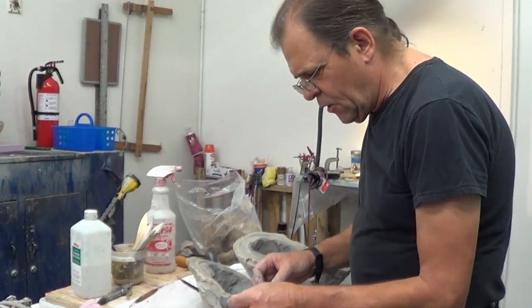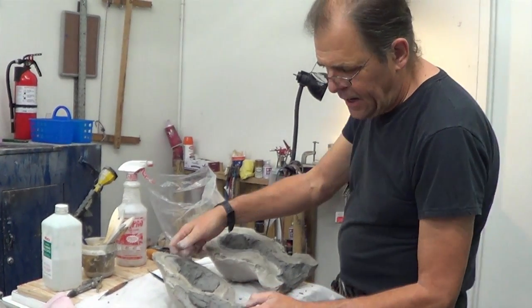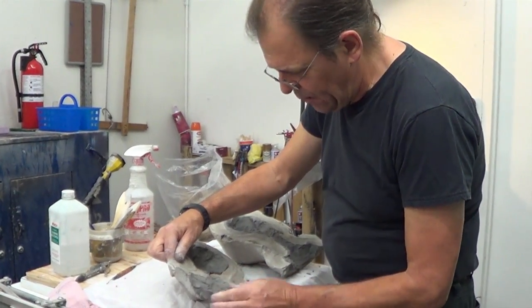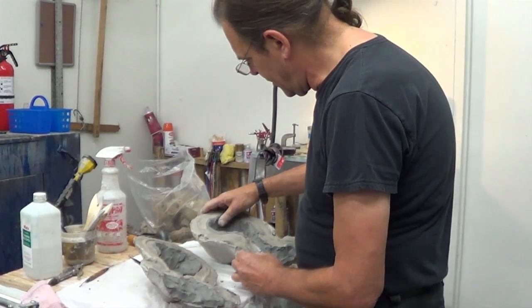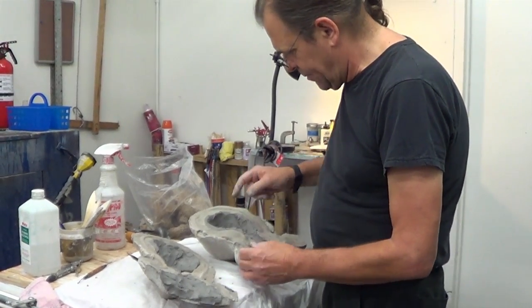Time to core the Martian mold, and what I'm doing is I'm taking the layup clay, the white clay as it's called, even though it's gray, and I'm laying it up inside the mold. Now what I'm trying to replicate here is the rubber. In other words, when this gets opened up, after the material's been put inside, there's going to be a rubber skin.